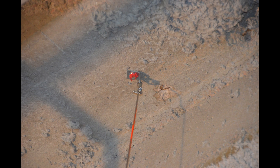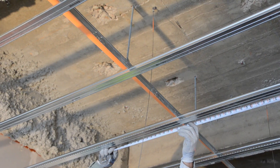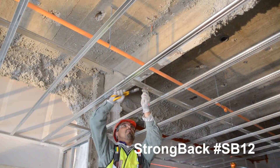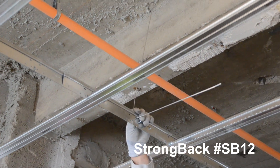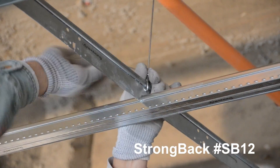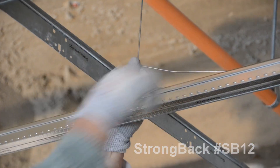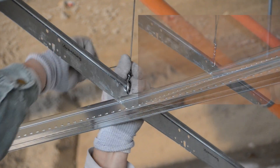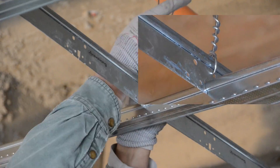We are installing a hard lid in this 13 by 23 foot, or 300 square foot, room with only six wires. You would need 18 wires with conventional drywall mains and four foot cross tees. It's critical that you tie your wires tight with tight loops around the strong back as shown — this will keep the whole system tight once loaded down with drywall.